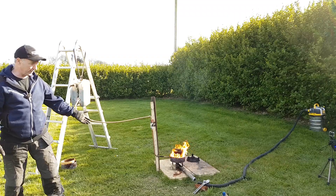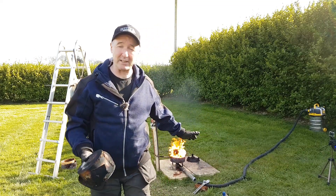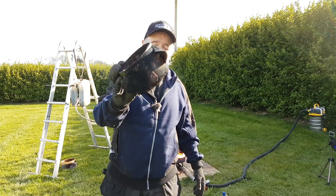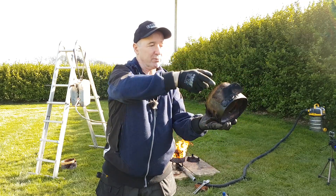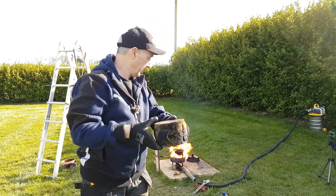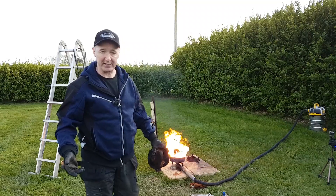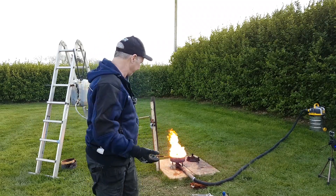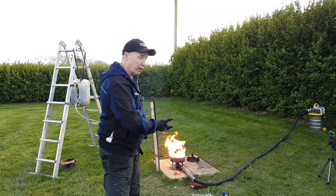So there you go — one waste oil burner. Couldn't be easier. I have lots of different designs of these things; this is just one burner I made. I've made lots of different types, tried them — some didn't work, most do. This is one I made where I can swirl the air anti-clockwise. I've put the full power of this vacuum directly into it now and you can see how brightly it's burning — it's getting a ton of air and we've got an aggressive burn, which is fantastic. We would have no smoke if it was inside the unit, but it's a great little design, very easy to make.